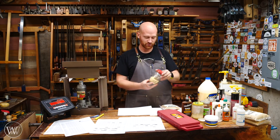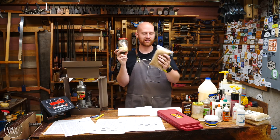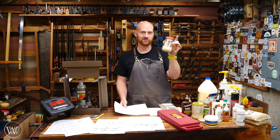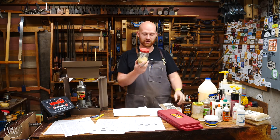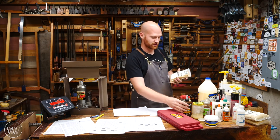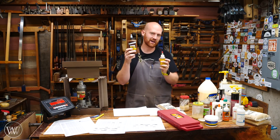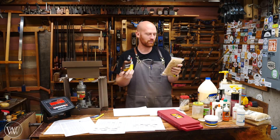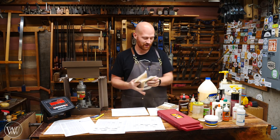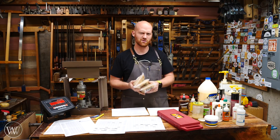The number one overall hide glue was my homemade hide glue, which actually surprised me. It's a little bit clearer but in most cases stood up fairly well. In the exterior test, it was the only hide glue that had a couple of blocks actually hold on — though I would not use it as an exterior glue, it would fail eventually. As for hide glue strengths, the 315 was stronger than the 251, which was stronger than the 192 — just as expected. All of these failed the external test, so don't use hide glue outside.